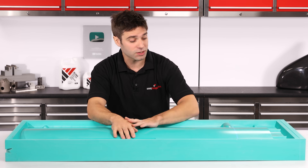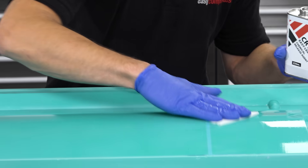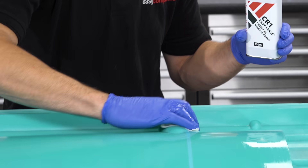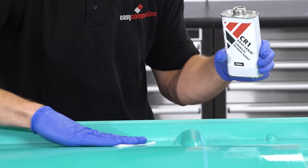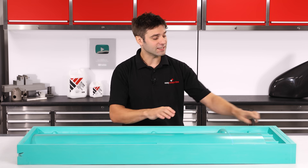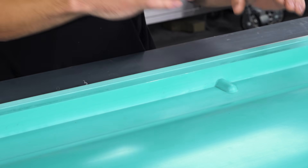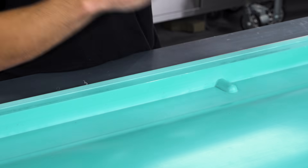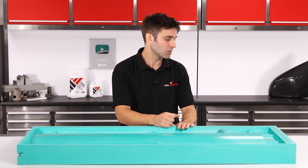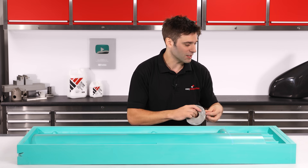I've finished the pattern as you normally would — I've put down six coats of S120 board sealer to seal the surface and then followed that up with six applications of EasyLease to ensure a good release from the pattern. One thing I would say about this particular pattern is that I haven't given myself much room around the outside. As I designed it for prepreg tooling, I didn't leave as much perimeter as I would have ideally done for positioning the vacuum consumables, but it will be perfectly possible, just a bit more of a squeeze.